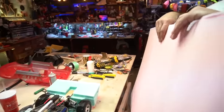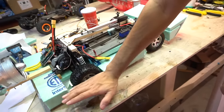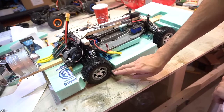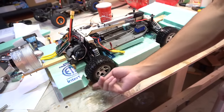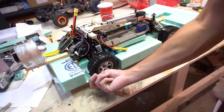Okay, so the batteries were dead, so that's not a very good test, but I noticed one thing when I was driving it. Since this thing is displaced far in the water back here, when it gets moving, the water comes around the surface, and because of fluid dynamics and its tendency to stick to surfaces, the water rolls around and still gets trapped in here. The big thing about this angled lip here is that once it gets going fast, the water will push down on this and help lift the back end out of the water.